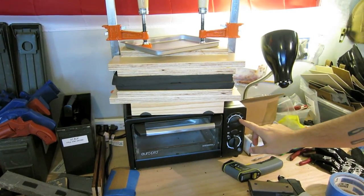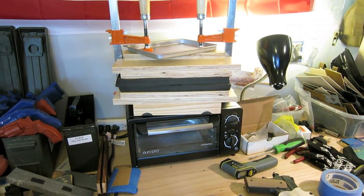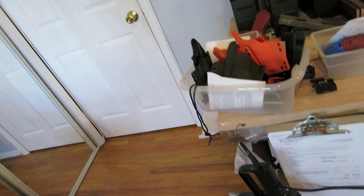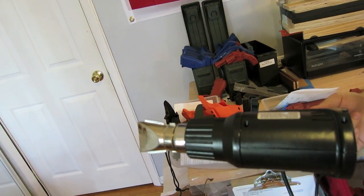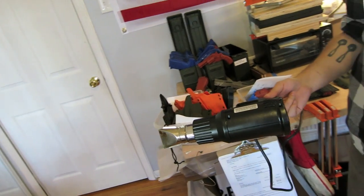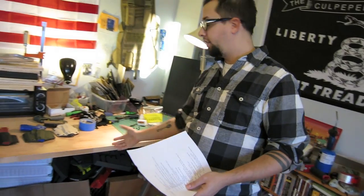It is ideal that you can achieve 350 degrees of heat out of your unit. You can use a heat gun, but if it doesn't go up that high, you may ultimately get substandard definition — because heat is a critical part of getting the Kydex to generate the kind of definition that you want. There are some really hot heat guns, and if you want to spring for one, that's great. But if you just want to supplement your oven with a heat gun for doing some finer forming, it's a good tool to have. Other people use alternatives such as an electric griddle — a friend of mine uses one so he can keep the Kydex warming evenly and monitor the temperature that way.